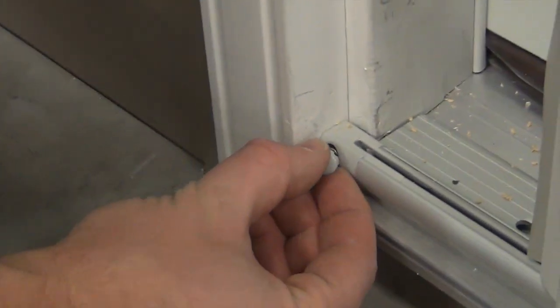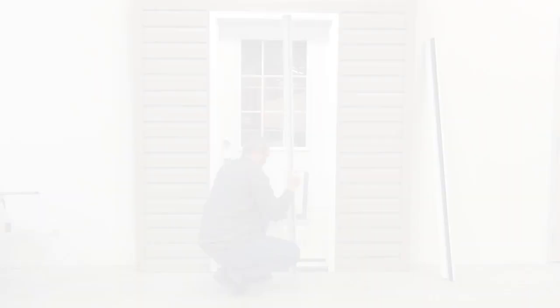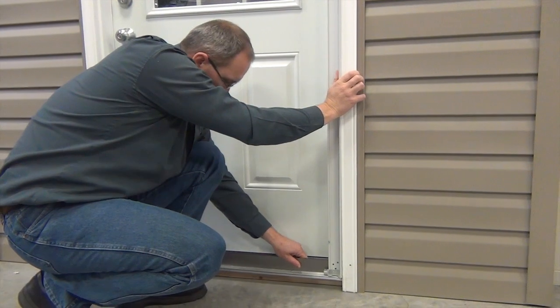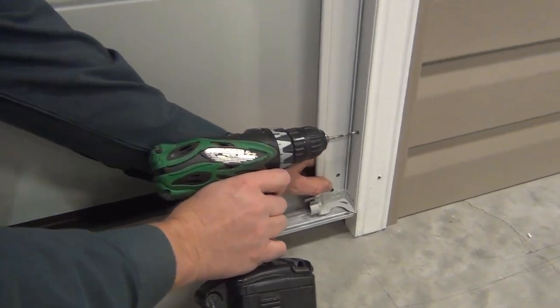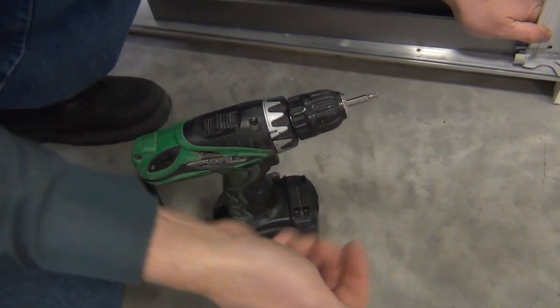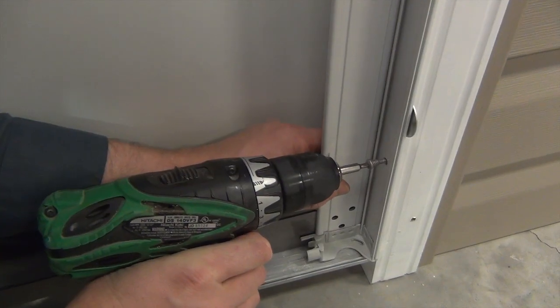Attach the provided screw covers for a finished look. Step 1: Installing the mounting plate. Use a carpenter square to make sure that the mounting plate is square to the bottom sill. If your door was special ordered as an inside mount, you should have two holes drilled in the mounting plate along the narrow edge of the plate. Now drill a pilot hole in the lower pre-drilled hole of the mounting plate. Next, use the washer to help hold the mounting plate in position while you install the patented screw.